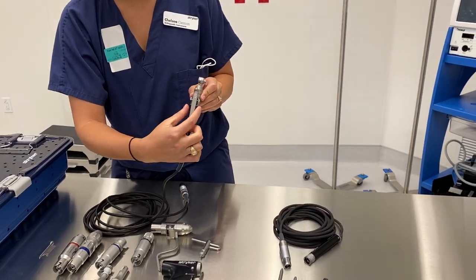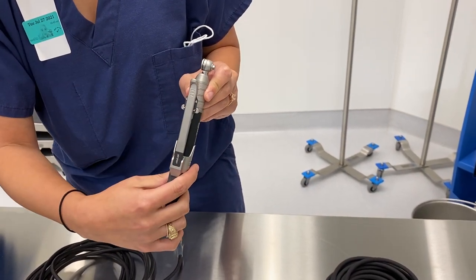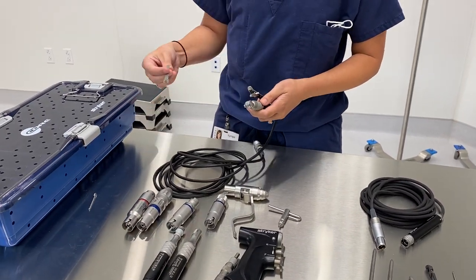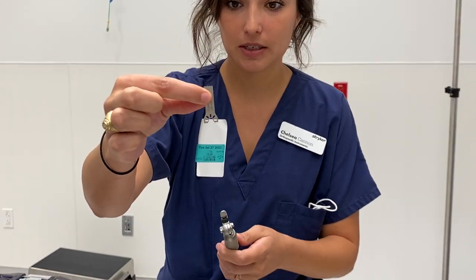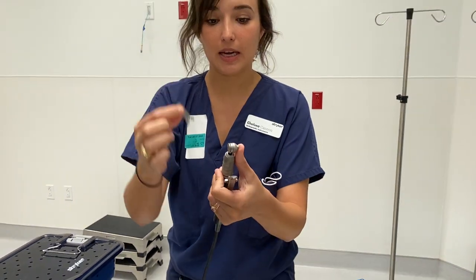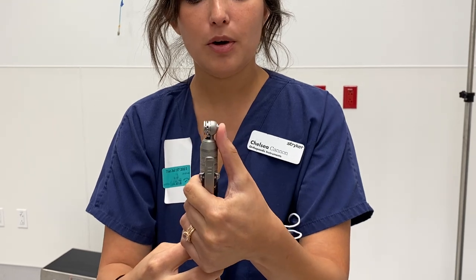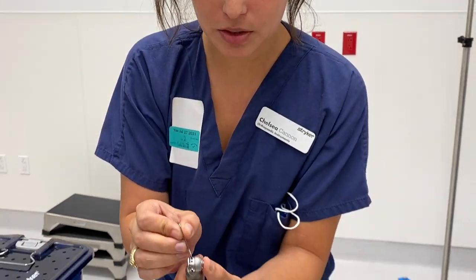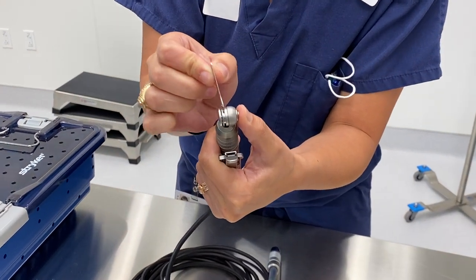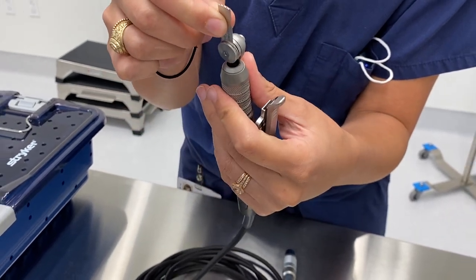Your safety is on the hand switch — it's locked right now so if it was plugged in it wouldn't go. Slide it down to unlock. Your blades are going to have little notches at the base, and to load your blade you're going to actuate the head by pushing this button at the very back. Most people think to put the blade in you use the larger gap — you're actually going to put it in that smaller gap in the front. So if you're wondering why the blade isn't going in, it's that smaller gap right in the front, and then it locks straight in — you'll hear it click.